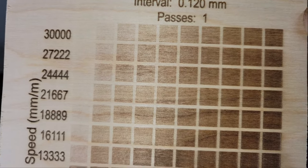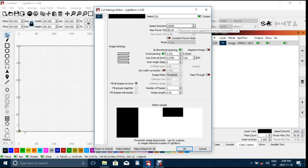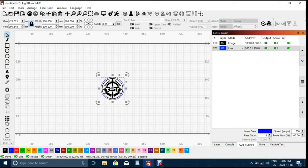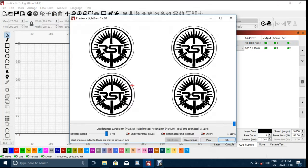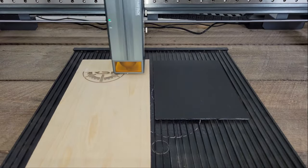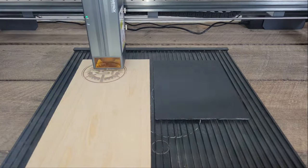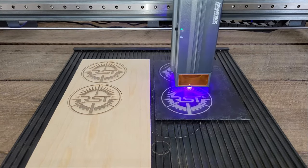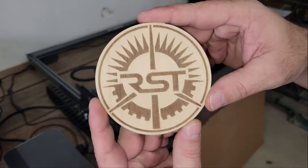So I moved on to making a few wood and acrylic coasters with my channel logo engraved on them by setting them up in LightBurn in different layers for batch processing. The settings that I used for the wood coasters were 10,000mm per minute for speed and 80% power, and for the acrylic coasters I used the same speed but only 40% power. These turned out great.